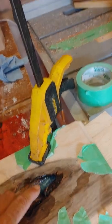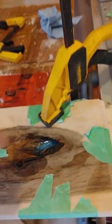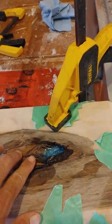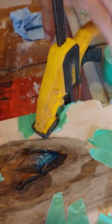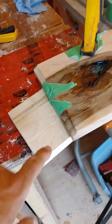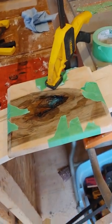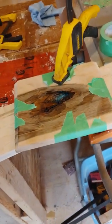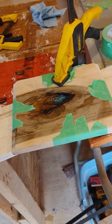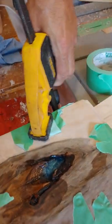What I probably should have done is take a two-stage approach: just pour enough to fill the cavity without reaching the top, so there's less pressure and weight pushing it through. Then once it dries after 36 hours, pour a second layer to bring it up to the surface. I also tried re-applying masking tape and clamping the piece down onto a spare piece to add pressure from underneath to stop the epoxy leaking. But I wasn't sure if that worked, or if I'd accidentally epoxied the piece to the scrap.